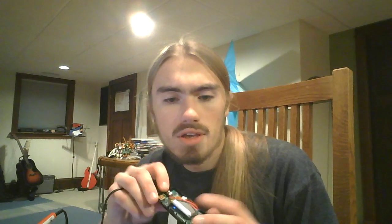The biggest problem right now is that the battery does not charge when it's plugged into USB. I think it's because this is only a two-wire battery, but there are three solder points here, and the old battery had three wires. So it had some sort of custom PCB on the battery itself, which apparently needed to properly communicate with the charger. I pulled the old charging circuit off the old battery, and you can see there are three wires — red, black, and blue. The blue one is the mystery wire; no idea what it's doing.